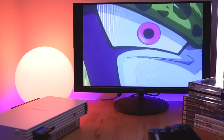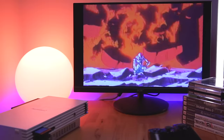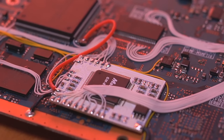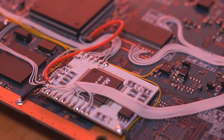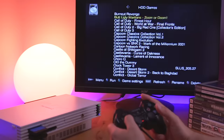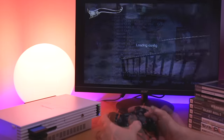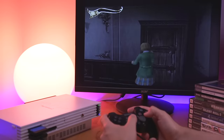Those are the main features of this chip. I think it is awesome to be able to natively play American and imported games from a single console, and using a mod chip is really the most elegant way to do it. Mod chips don't usually play nice with soft mods like FreeMcBoot, however for whatever reason this Mars Pro chip works just fine with it. In a sense I have the best of both worlds — I can play PS2 games loaded on my hard drive and play physical copies of American and Japanese imported games. It's like having the ultimate PS2.